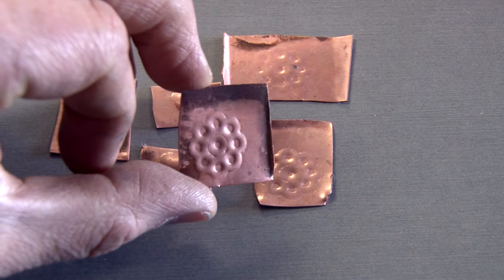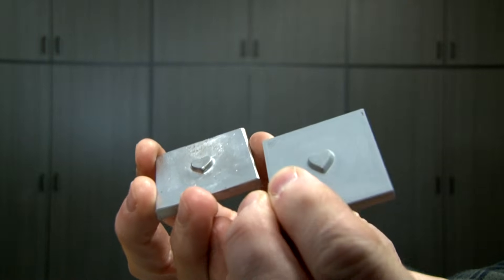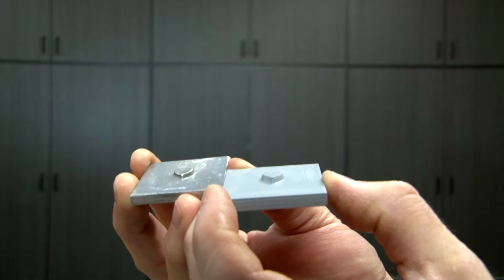This one looks better when you move it around — you can actually see it went in pretty deep. You made it to the end of the video, but the little rubber piece didn't — I went through a couple of those because they just get smashed to bits. I think you'd want to use urethane to make it function well. The other thing that didn't hold up was I pressed some steel sheet a few times with the die and it definitely deformed. When you turn it sideways you can see the aluminum die did get crushed down a little bit and is slightly concave. But it held up a lot longer than a 3D printed PLA die — I tried one of those and it completely smashed out on the first press. Thanks for watching; I hope it gave you some ideas. See you next time — take care.